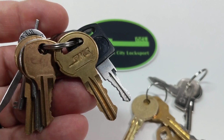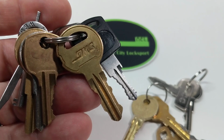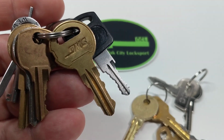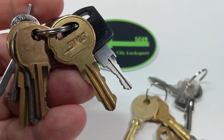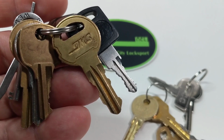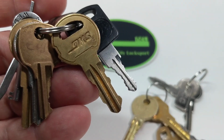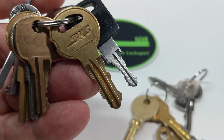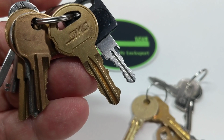And there's typically a call button, so maybe you could talk to somebody in security, or you actually enter a small series of numbers and talk to somebody in a particular apartment or office. These will allow you to open up the faceplate of the telephony entry system and either short a relay or actually hit a momentary release button so you can open the door. Just be careful. Some of those telephony entry systems may actually have tamper alarms and you'll set off an alarm.